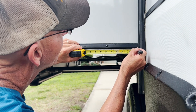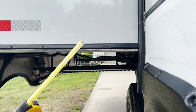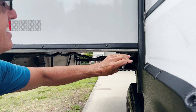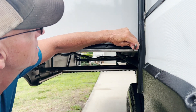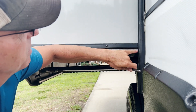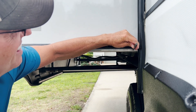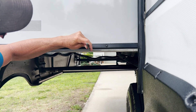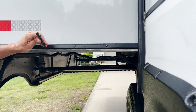Get your handy tape measure out and your magic marker, and come over eight inches, make a mark. From that mark, come over eight inches, make a mark — eight inches, make a mark, and then eight inches, make a mark. Then take a punch and a hammer — a little pin punch — and come up maybe a third of the way down from the top of where the bar is, and just put your little dimple to keep your drill bit from rolling around.